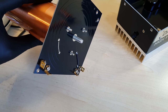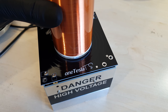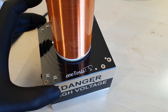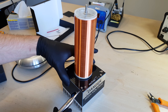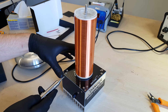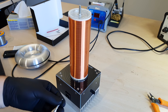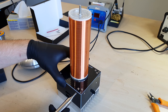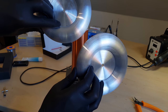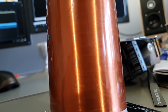The jumper cable connects the low side of the secondary coil to ground and protective earth. There are no other connections to the secondary. The very high voltages we are about to witness are solely relying on induction. And because the coupling of the two coils is relatively loose, there's not a lot of energy to back up our megavolt — I'm not saying the thing will be safe to touch, but it's not the ultimate death ray either. The aluminum donut is called the top load. With its large surface area it acts like a capacitor, and that combined with the secondary coil makes an LC oscillator.